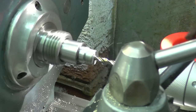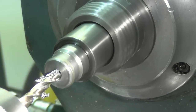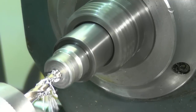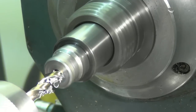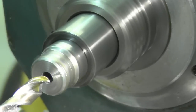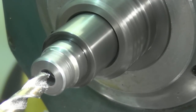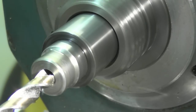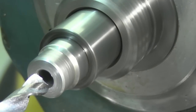Keep pulling the drill out and get a bit of cutting oil on the end. Just go up the stages. This is the last stage — this is the 7.9mm drill, the one I keep stepping up to just before reaming.